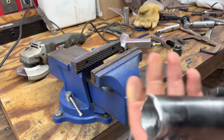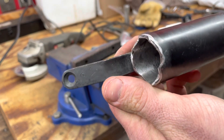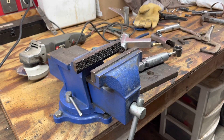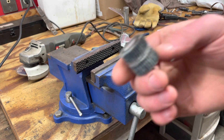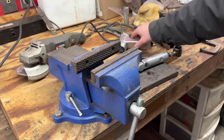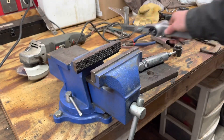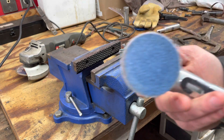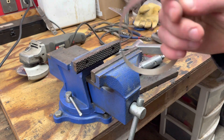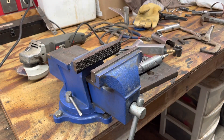Did a complete grind off all the slag inside and outside. For inside, I use a die grinder with some one-inch flap wheels — they're pretty universal. Coarse grit, you don't need anything fine for now. Outside grinding, I use my little 3A's belt sander and sometimes just a die grinder with a sanding disc. I could buy a whole different belts of grit for the belt sander — some fine stuff, some coarse stuff, depending on the finish you want.